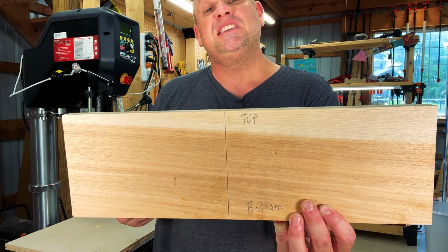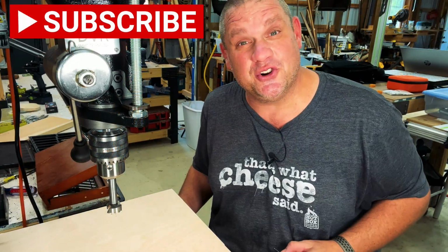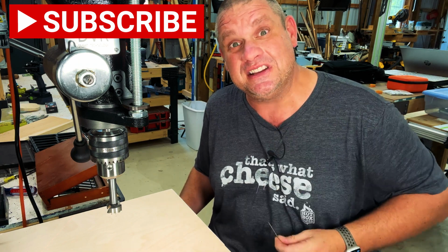We're going to set this piece of wood to the side for a bit and move on to our next step. So I've clearly got a Forstner bit installed in my drill press, and this isn't going to work for calibration. So I want to take a 1/16 of an inch drill bit and install it into my drill press.